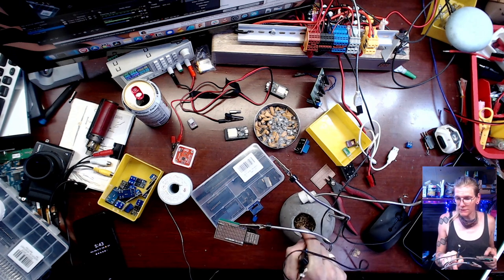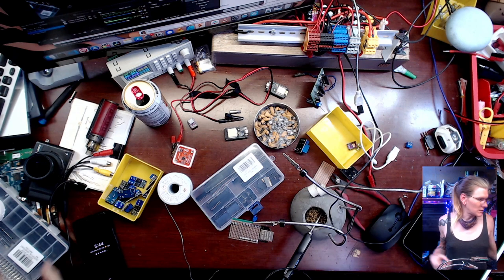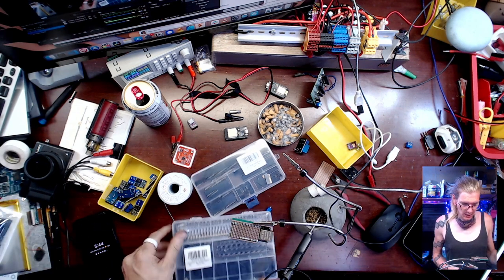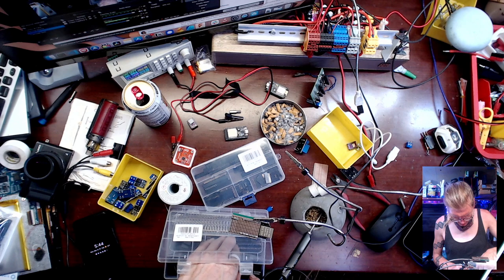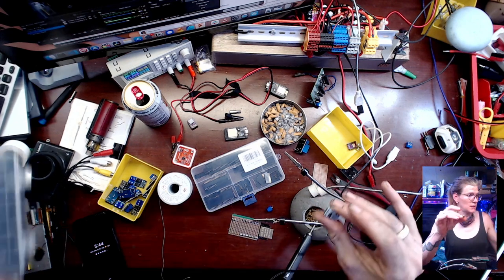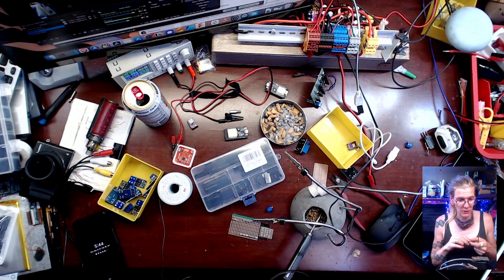I'm going to have to be careful, and before anything, when this is hooked up, before this is actually given power with the board on it, I want... are any straight ones in here? Cool. I'm going to have to set this to 5 volts, because if I don't and it's too high, we're not going to be happy. Things will be bad.